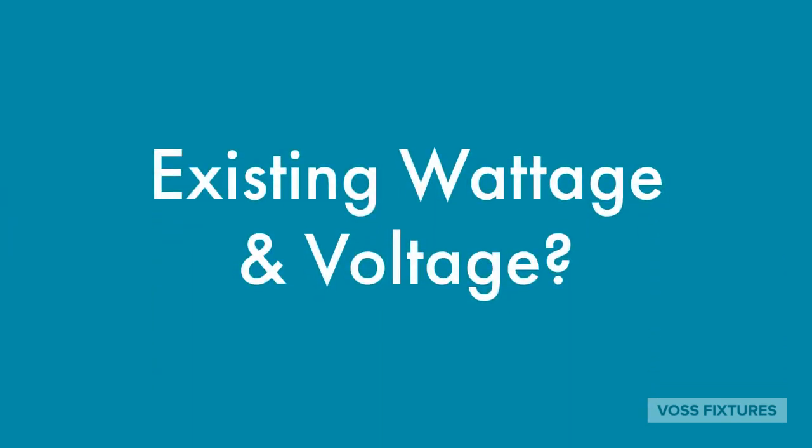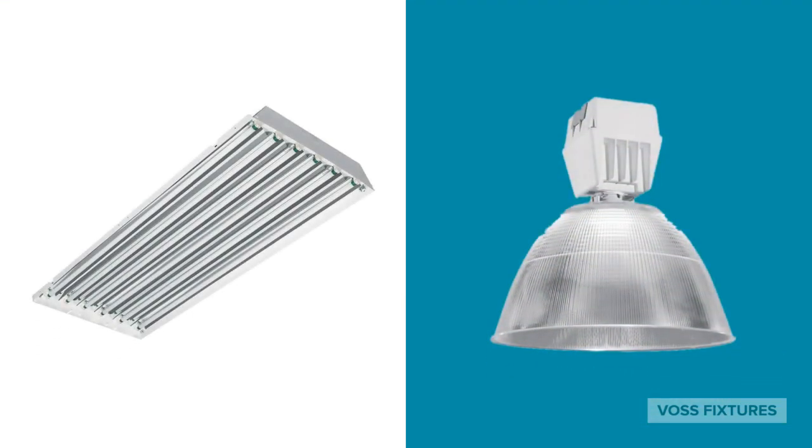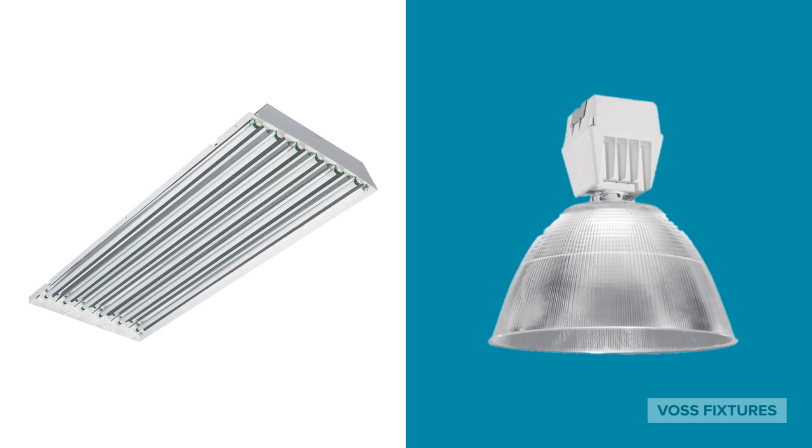In choosing an LED replacement, it is important to know the existing lamp wattage and the voltage at the facility. Finding out the customer's existing lamp type and wattage will help us choose an LED lumen package that will be comparable. Voltage is also a key piece of information, as many high bay applications use 480 volt, but not all of our fixture options are available in 480.